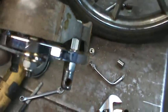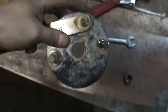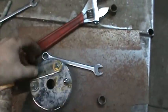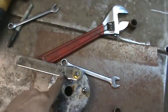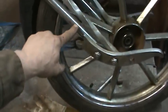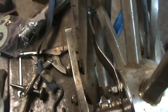Get that drilled out and put in there — actually shaved a little bit at the top of that shoulder bolt, put two tacks on it to make it a lot easier to tighten. Now I've got to jam that on with brass spacers, and that should make for a good mounting bracket. We're going to put it all back together and figure out what kind of bends we need to attach it to the rear tube of the front end.